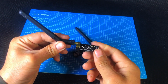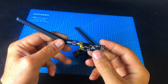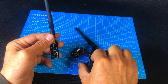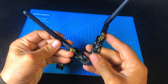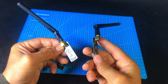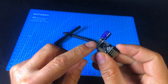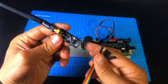Here, as you can see, I have two different types of NRF24L01 modules. One comes with an antenna while the other is without an antenna. The version with the antenna is typically used for long-range communication such as in drones, RC airplanes, or long-distance wireless projects. The NRF module without an antenna is ideal for short-range applications like RC cars, boats, or home automation. For today's project, I'll be using the antenna version on the transmitter side and the non-antenna version on the receiver side.